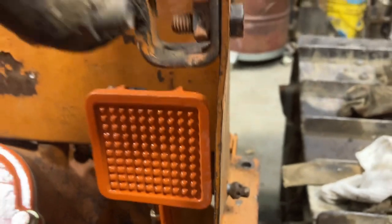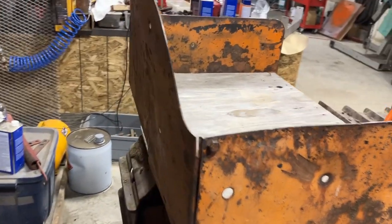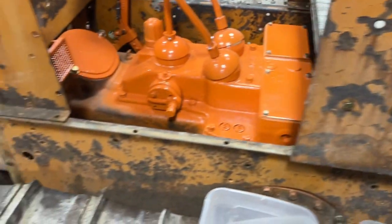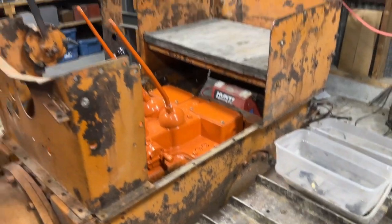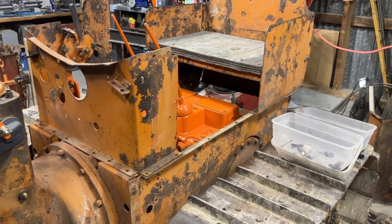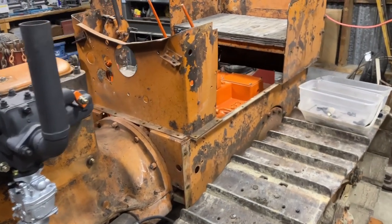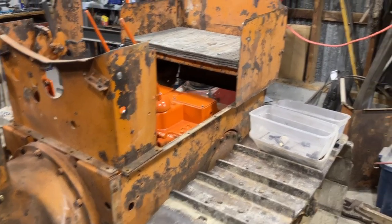This plate here is bent pretty bad. A lot of this upper seat stuff — it's hard to see but it's all pretty twisted and warped, and there are a lot of stress cracks. This whole seam underneath has been welded up. The bottom ones I got pretty straight, but I'm contemplating in the long run doing full replacement of all the panels. I was also looking at maybe going to 3/16ths or even quarter-inch plating, just to stiffen it up a bit and give it more rigidity on some of the longer panels and maybe even the seat stuff.